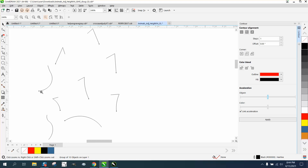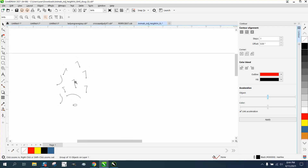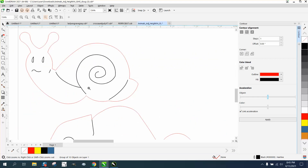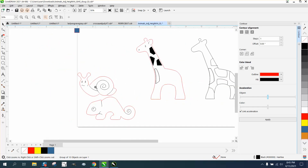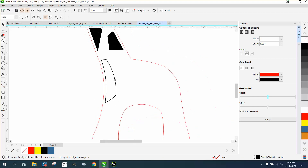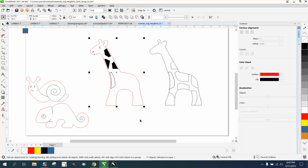If you want the lines a little thicker, just raise your focus up — because that's all you're going to be doing after you cut out all your pieces: lay your pieces in there and vector engrave this. Just raise your focus up a little bit and it's going to zip through. You could run this at 100 power and 50 speed, and it's going to cut a really good line. If you take it out of focus like an eighth of a quarter inch up, it's going to make a thicker, wider line because the beam's going to get wider. Especially on these two animals, that would vector engrave ultra quick. Anyway, I hope that helped a little bit. Thank you for watching.